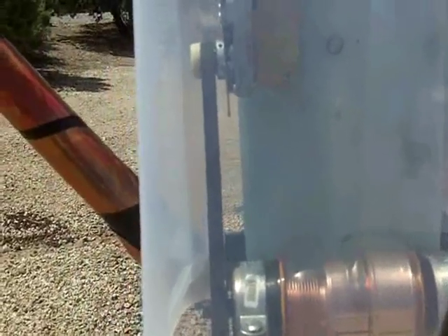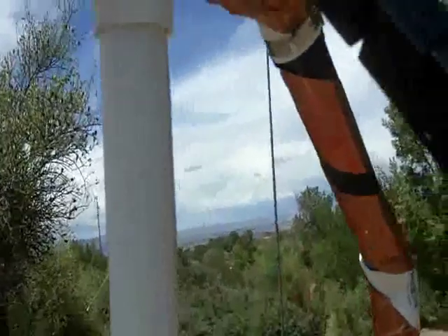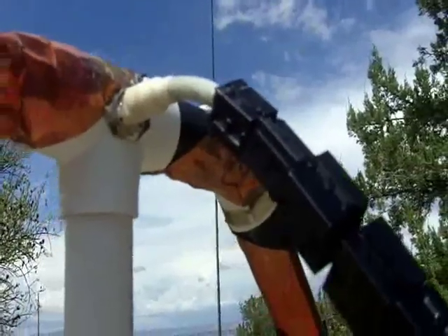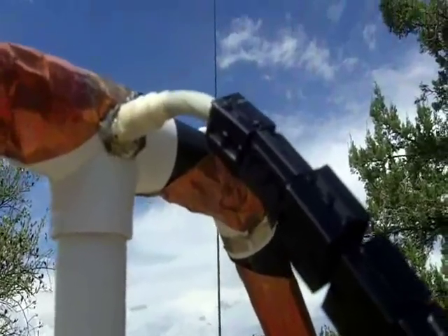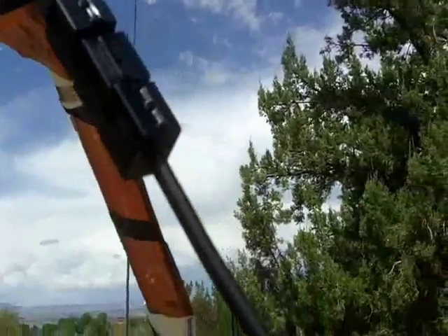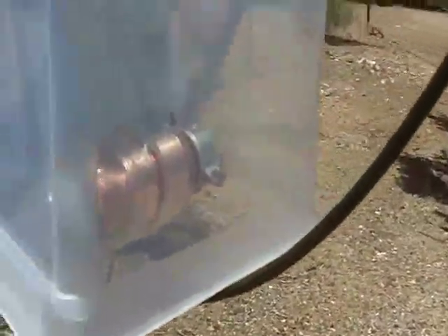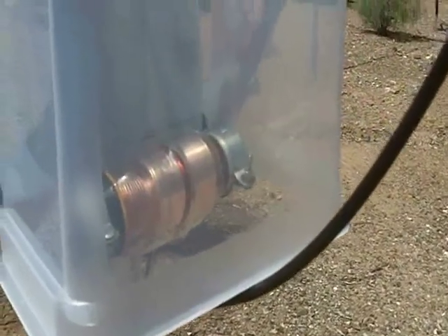Future plans for this antenna, which I'm currently working on, are going to employ a stepper motor system, which will move from band to band relatively quickly. I've supported the coaxial cable away from this loop because I am feeding it at the top, and I want to keep it out of the loop area of the antenna. So we're feeding it there and routing the coaxial cable around the high voltage section.